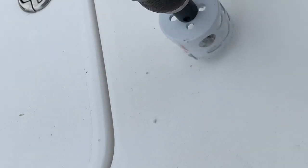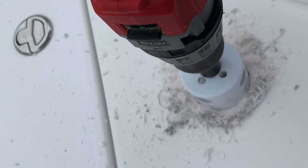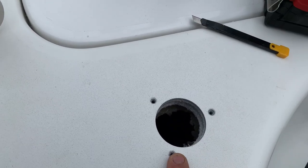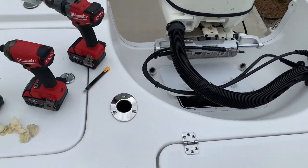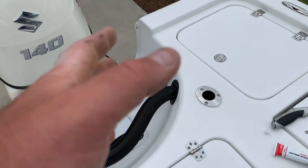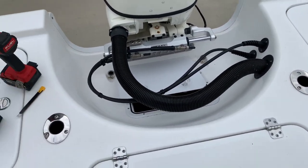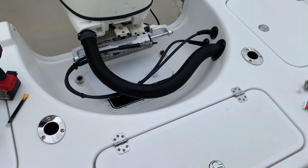I've got my mark where I'm going to drill with the hole saw for the second one. Drilled pilot holes and countersunk them. Now putting some marine sealant in the holes. These are zero degree flush mount rod holders. With a spot like this you could probably pull a 15 or even 30 degree rod holder on these 208s. The only spot of concern was over there — you just have to push it back a little bit. Make sure you take photos from inside the bilge before you start, to make sure you won't hit anything. I'm pleased with how this came out — they look clean, sealed up real nice.